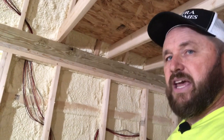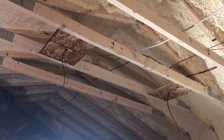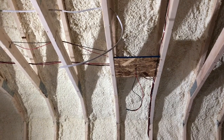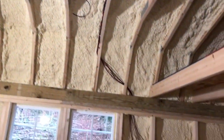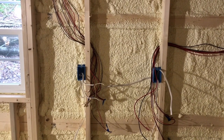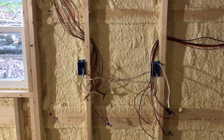I'll reverse the camera and show you what I did. On the ceiling, every spot where I'm going to add a light I went ahead and put in some wood backing, and you can see the wires hanging down from the wood backing. That's all my solar lighting — the stuff with the red and black wires. The big white Romex coming through is for a ceiling fan I'll use sparingly on solar. This area is where my fuse box and the main controlling switch for turning on and off all my solar power will go.